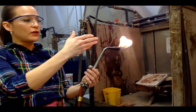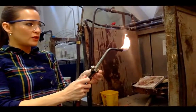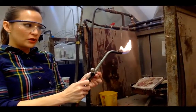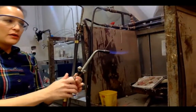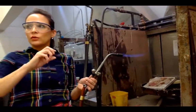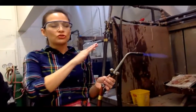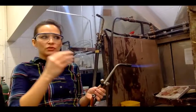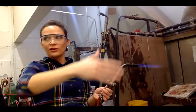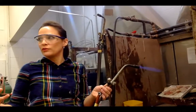You can't do a whole lot with this fire unless I add some oxygen to it. So now I'm going to add the green line, which turns on the oxygen, slowly until I get a blue flame. When you turn on the oxygen too quickly, it will extinguish the flame. If that happens, just turn everything off again and start from scratch, because what you don't want is a bunch of natural gas in the air when you light it — you're going to get a huge boom of fire.